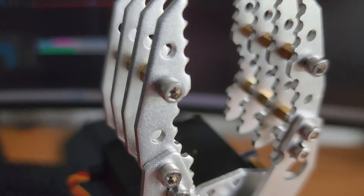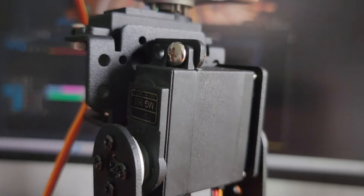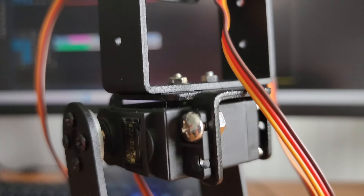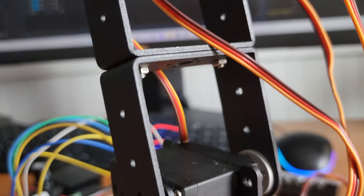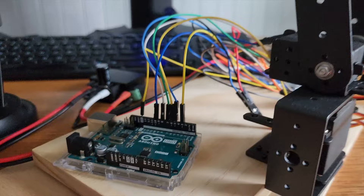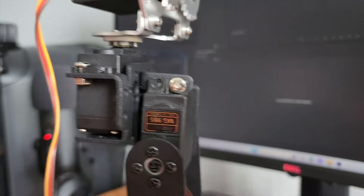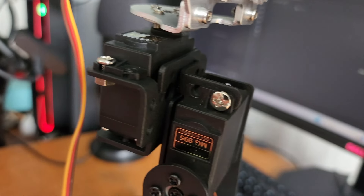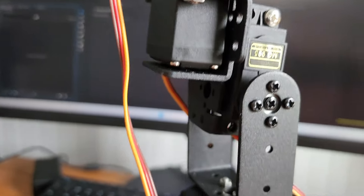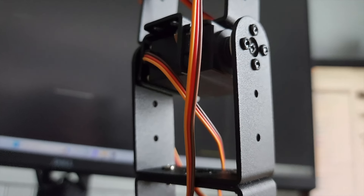It's a little bit frustrating, so I might be upgrading my gripper in the near future. The MG996R servo operates the gripper while all the other servos are the MG995. The MG995 servos probably aren't ideal for the rest of the arm — ideally I want the MG996R with more torque — but the MG995 is what I had, so it'll work for this demonstration.